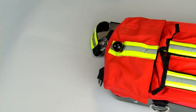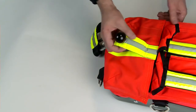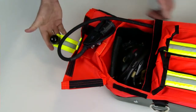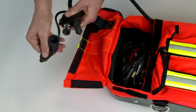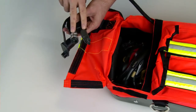The low pressure side can be determined by looking at the strap — it has a ball attached to it, which can also be felt with gloved hands in low-light environments. The six-foot low pressure hose and manifold can be attached to the lid of the compartment for easy access. The manifold is equipped with a male and female quick-connect, just like the fittings found on the Scott Dual EBSS system.